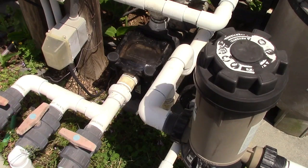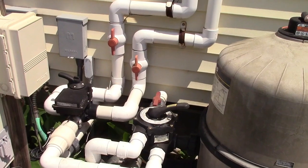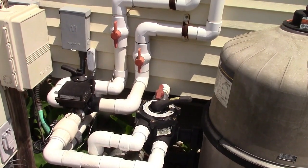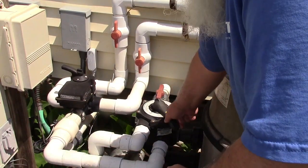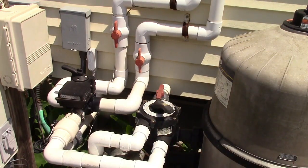Everything should stay. It is very helpful if you have a second person who can prevent your vacuum from falling in the pool, because otherwise, you might be going in after it. Go over to waste. That disconnects your filter. If you have a heater, disconnect that. Get everything out of circuit. And we're sending water straight down. And now, I'm going to head back over and we'll start vacuuming.